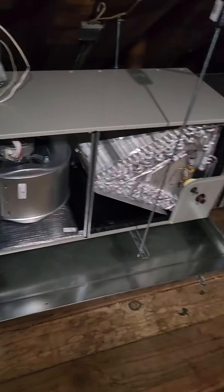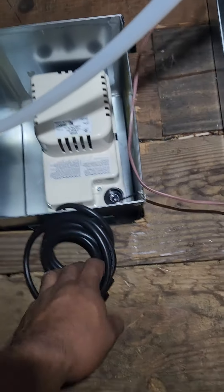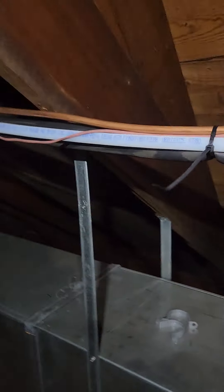This is what the inside of the air handler looks like for your AC. I took the covers off to work on it. This transition is new into the old existing ductwork — usually if we're replacing, the ductwork is fine so we just leave it. Installing new ducts adds about 30–50% more cost, so they just leave that. This is a pump, 208/230, and this brand new drain runs all the way out through the eave.